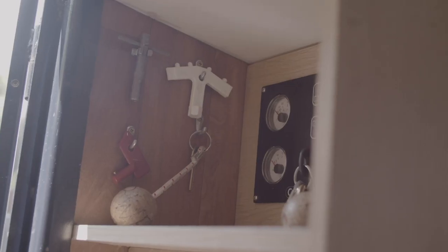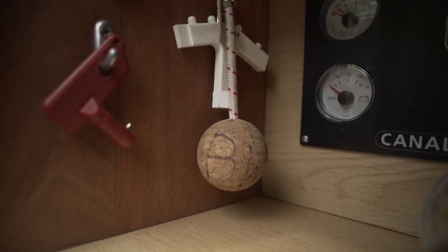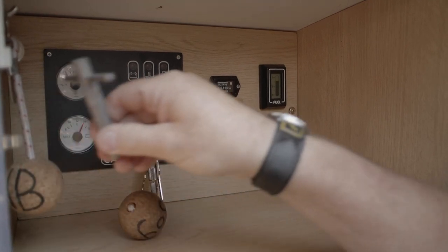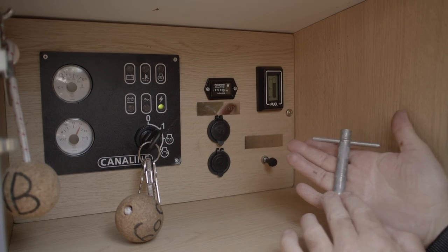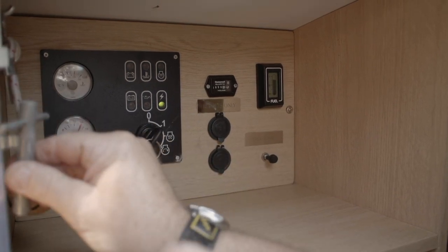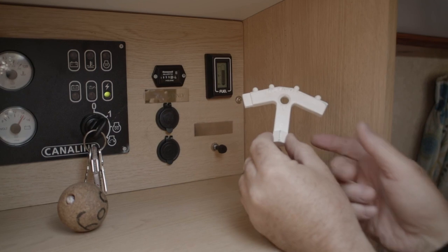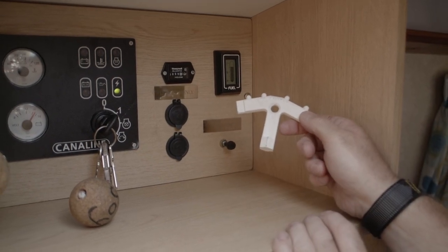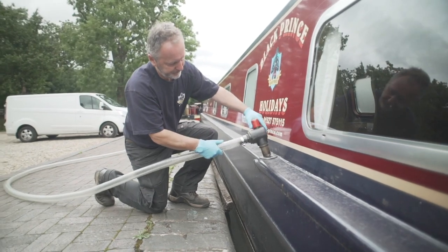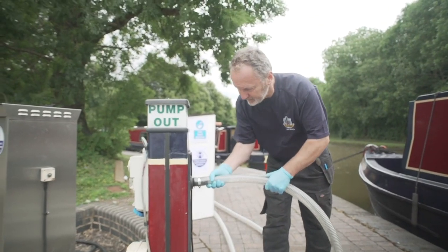You'll be given a selection of keys when you take charge of your narrowboat. Your most important key, after the one that switches on your boat, is the British Waterways key. This one key opens a number of locks, gates, swing bridges and water points. The second key is the anti-vandal key — a few inner city locks will have additional security on them, so before you can open the lock paddles, you will need to use this key. In your key collection you will also have one to access the discharge unit. Toilet waste is collected in sealed tanks on board. Depending on the amount of usage, the tanks will hold water and waste for 4 or 5 days. If you are on a holiday of a week or more, then you will need to get a pump-out during your trip. Boat marinas or bases similar to ours will manage the pump-out for you, and the Black Prince team will be able to advise where to do this. There will be a small charge for the pump-out.